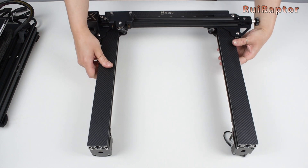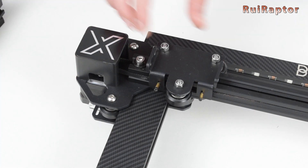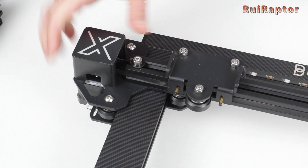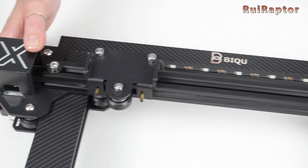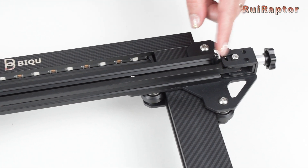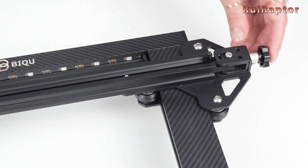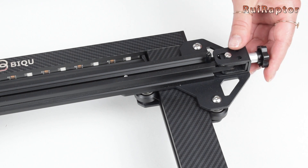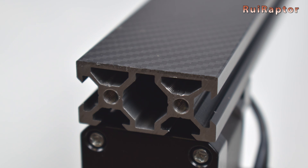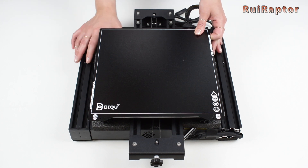And this is the front side of the top half. Like the printhead, the X carriage is a small one. For the X axis we cannot find any end stop switch, which means the driver is set with sensorless homing. On one end of the X gantry we see the X axis belt tensioner. On the side of the frame we have a carbon fiber effect that looks super cool, but actually there is no carbon fiber here — it's a sticker on the aluminum profile, but it still looks pretty cool.